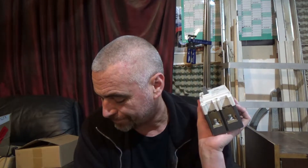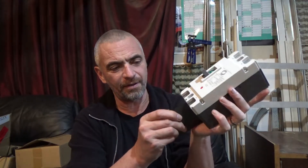The inverter is good for 4 kilowatts for a short period, 2 kilowatts constantly. I'm not entirely sure what I'm going to use that for, but I think it would be good to have a very high-powered inverter. It has little flaps to protect the positive and negative cables, because you're talking about some real serious power here — this is going to trip at 250 amps, which is maybe 6 kilowatts or so. It's huge power. I'll have a link to this in the description below, and if you're in New Zealand there is no cheaper way to buy this.